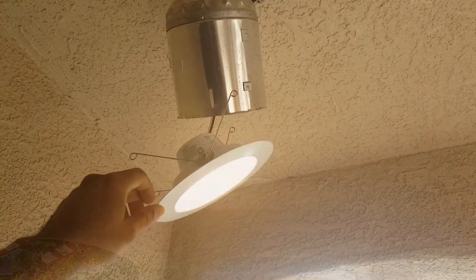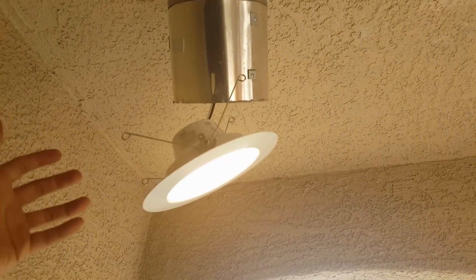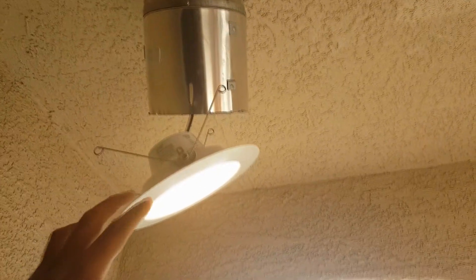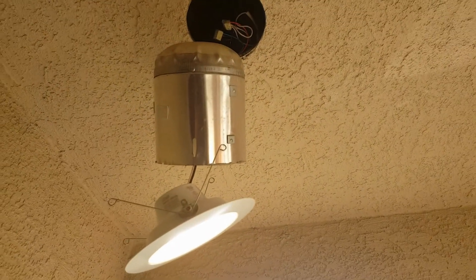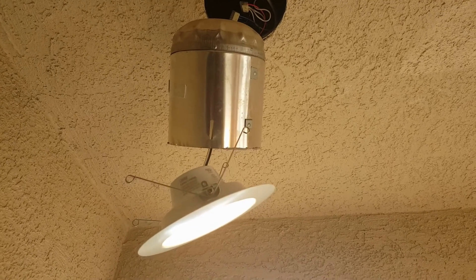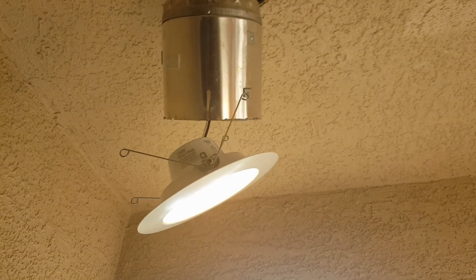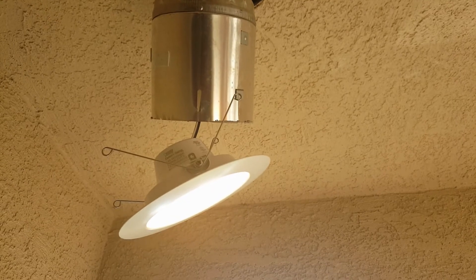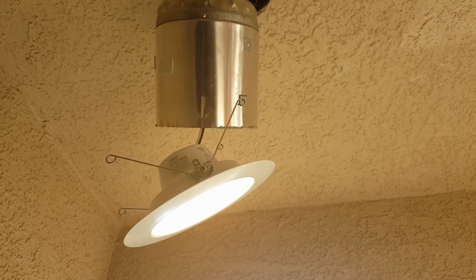I hope this helps you figure out what you want to do. This is a little more work — had you bought the 4-pin to round socket connector, you would have just popped that in and directly connected the LED lights. But I feel this is the best way because you bypass the ballast entirely. These lights are dimmable, so I'm going to possibly add a dimmer down the road, and it's best to have that ballast module out of the way.